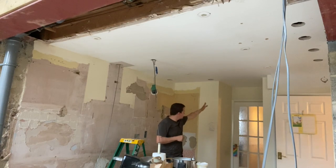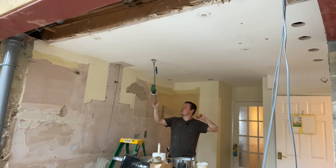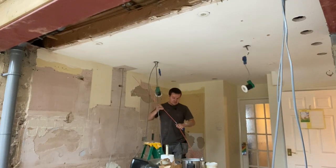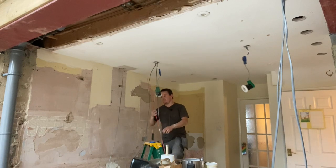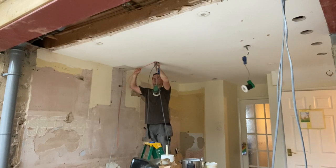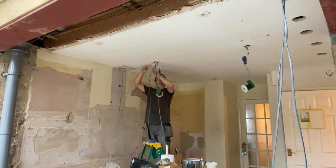I've also got to bring the thermostat this way and a two-way lighting cable to two-way these lights from that switch to this switch. Between this ceiling and the bathroom there's insulation — I think they've done it to reduce noise downstairs. My cables will be sandwiched between the plasterboard and the insulation, so I'm hoping there are no noggins in this floor and I can go all the way through.